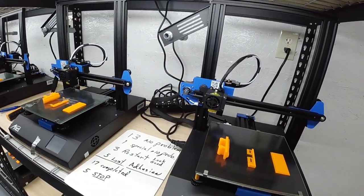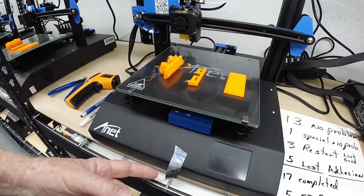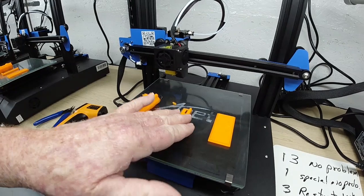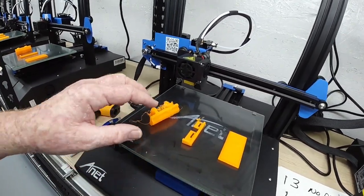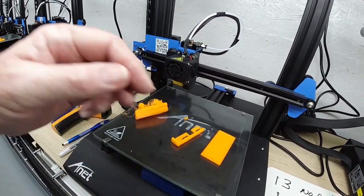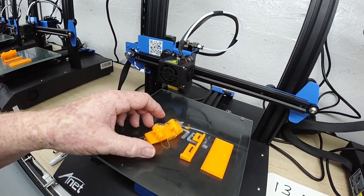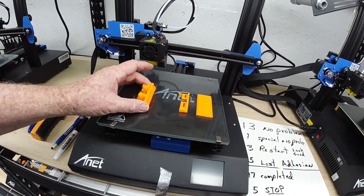So if we had eight on the top, this would be printer number nine. It looks like it did print, but got a little flag on it. These two parts printed, but when it got to this one, it broke loose. Usually when the adhesion isn't real good — you can tell it isn't because these parts just lift off — sometimes they'll do okay at a low profile, but once they get to a certain height, that little bit of friction is enough to knock them loose. And that's what happened here. The printer did all right, it's just the adhesion on that one.